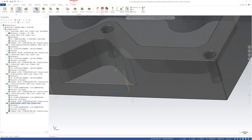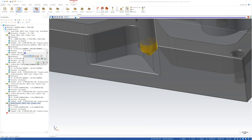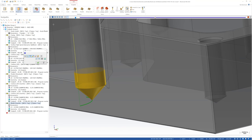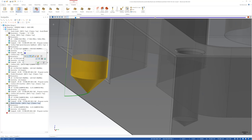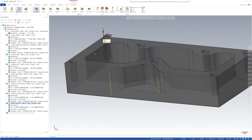Let's backplot and walk through it. I'm going to play it, hit S, and turn so we can take a look. See how it's off right there — meaning off in a good way, like it doesn't hit. That's the cool thing about that toolpath. We can go right through it, come out, and all of our chamfers on the top side are complete. Now we're going to take the chamfer mill, chamfer these holes, drill and tap, and the part on operation one for the Titan 1M will be done.